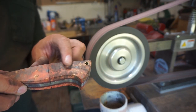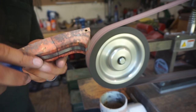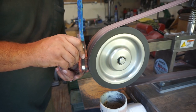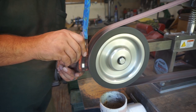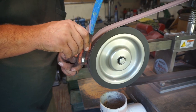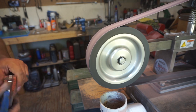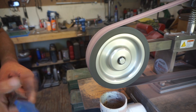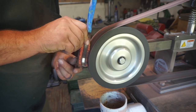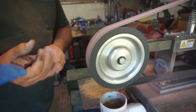Now we're going to be using the 8-inch contact wheel to start doing the curved part of the coke bottle — from that center line all the way back to the butt of the handle. Because of the way I shaped the handle, I had to actually rock it back and forth, since I've got a smaller curved area towards the bottom and a longer curved area on the spine. I had to focus a little differently and rock it back and forth to keep a consistent curve and make it ergonomically correct.